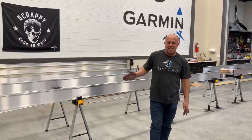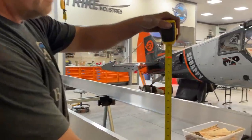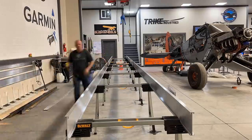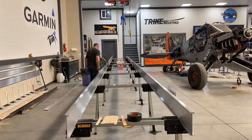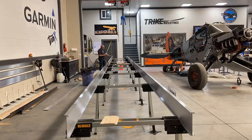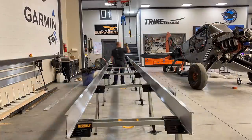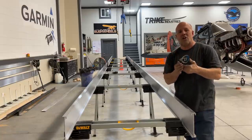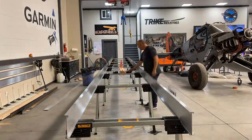The most important thing I've got to do now is get out my laser. I've got a very accurate laser — I'm going to dim the lights in here, it sets a red line, and I'm going to laser-set both wings perfectly straight from end to end. Now that I've got all the shims and it's perfectly set, I'm going to lift my table spars out and put tape down to hold these sticks in place. I shim with sticks to make a nice solid surface and then use tape to layer up to get it absolutely perfect.